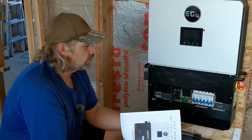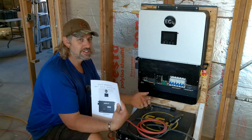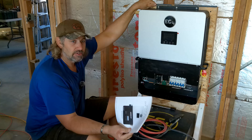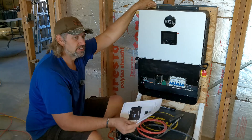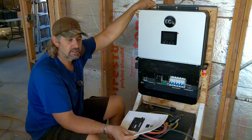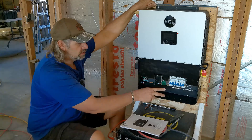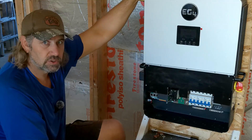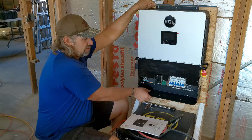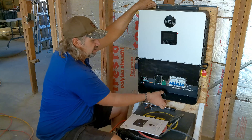Obviously read your owner's manual before you start wiring anything up, research all you can, watch a whole bunch of YouTube videos. I'm not an electrician — I'm just a guy that likes to have power in his house. So I'm going to hook this up kind of differently than other applications. I'm obviously not going to show you how to parallel because I'm only doing one unit. Always be safe — you're dealing with 240 volts, and my PV is going to be coming in at around 300 volts, so you've got to be careful. Unfortunately I don't have the pieces to hold the wires so I'm just going to go without for now.